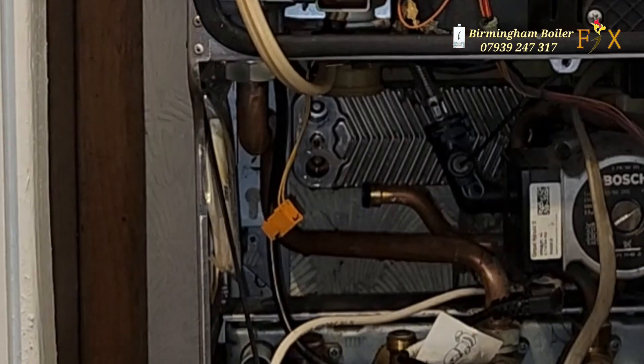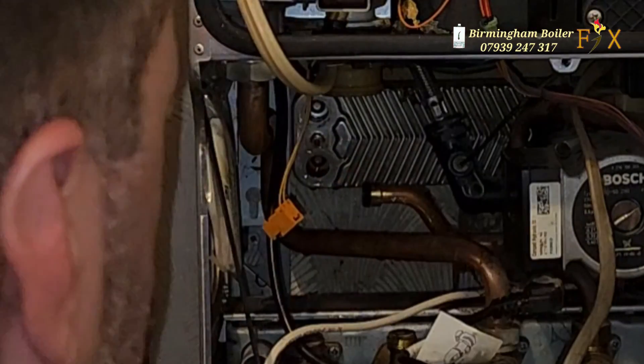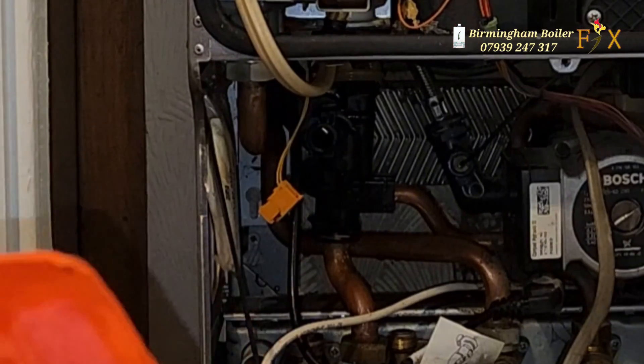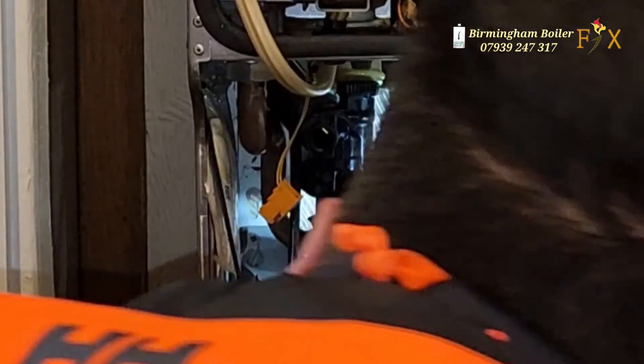Back to the serious business. I've got the manifold in. Where I've got the bypass fitted — I tried to connect the 22mm flow copper pipe to the manifold first but was finding that difficult. So I took it all back out, put the 22mm pipe in first, then put the manifold in, and that was much easier. I put the manifold in at an angle, then connected the bypass to it and clipped it all in. After that, everything else was a lot easier.